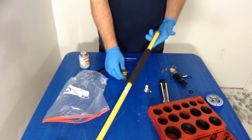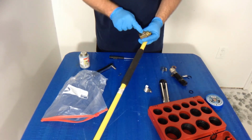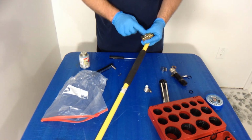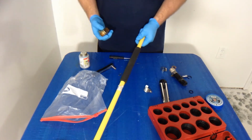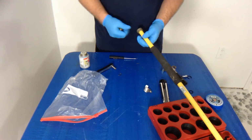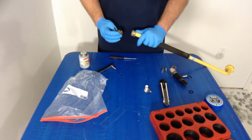Alright, now onto these shower wands. A lot of people have trouble with this leaking. All you do is tighten this down. The factory rarely tightens it down enough. You probably need a power screwdriver and push in hard, with high torque. The seals in these are hard and crappy, so that's why you need to really torque this screw down here.